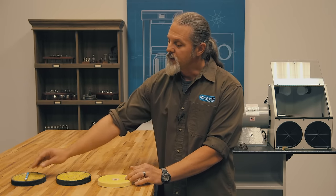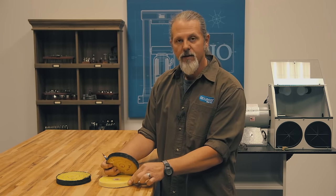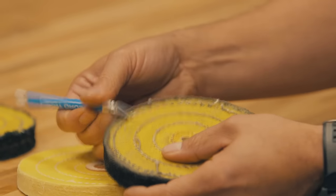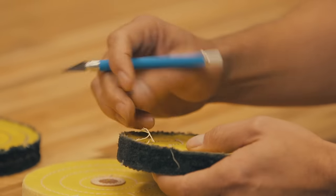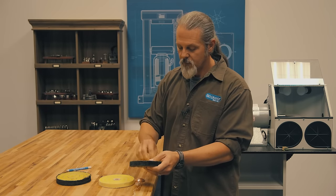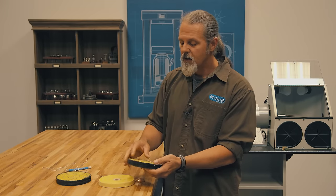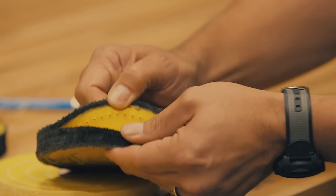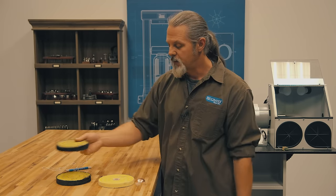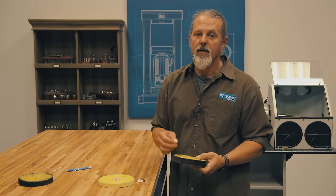One of the great things about these stitched buffs is that as you use them they get really stiff. What you can do is actually remove the stitching when it gets too stiff — just take a knife and pluck it up a little bit, do both sides, and pull the string out. That'll open up a whole new layer for you to keep using. It will be softer, so if you want a really stiff buff keep the stitching, or remove it for a softer buff. You can do that on all the different stitched buffs, not just the yellow pre-treated ones.